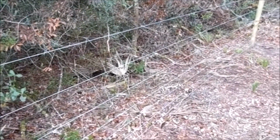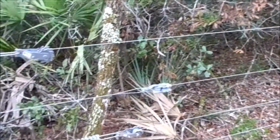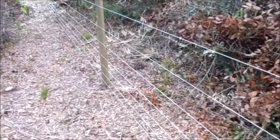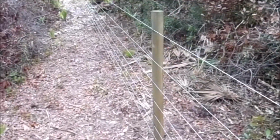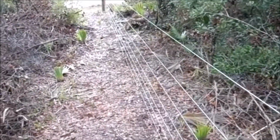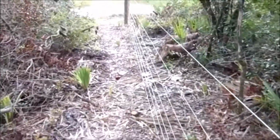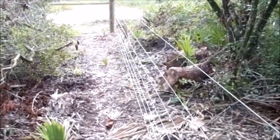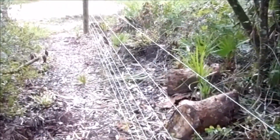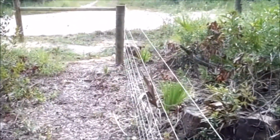On electric fencing, it can be lower due to the fact that the fence is electrified, and any animals that touch the fence should be fleeing the fence, so the strain will not be as high, and the overall tension of the fence and resistance it offers doesn't have to be as high. So that's the other advantage of electrifying your high tensile fencing: the tension on the lines does not have to be as high, and if you have less tension, you have less stress overall.